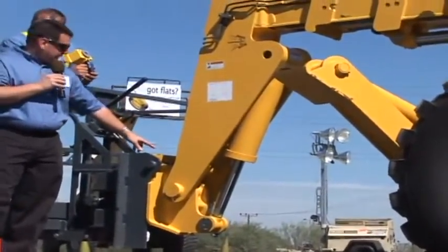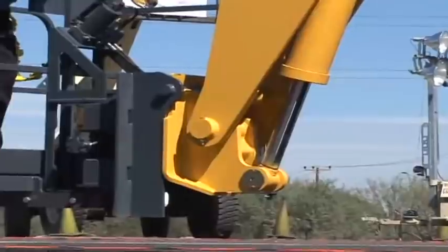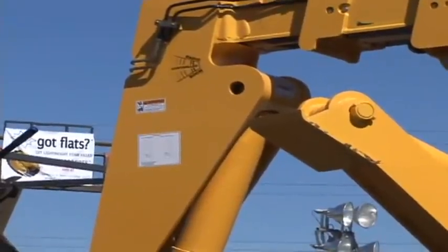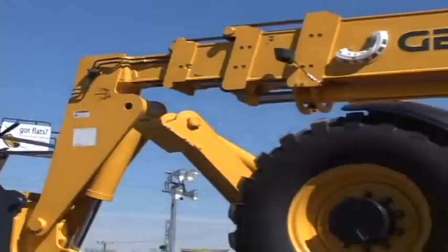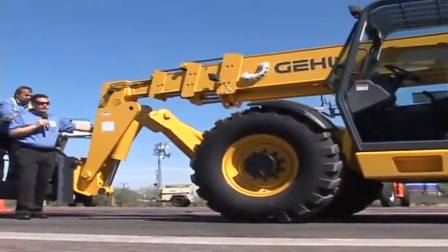This is the Dyna attach that we have. It's a narrow one, used for lift and place type applications. Then we also have what we call a Dyna carrier, which is a wide mount type attachment, which would be used for bucket or high force applications in which you want more stability at the horse head. We also have the auxiliary hydraulics that's standard on our 55 foot boom. That's on the other side, which we'll get to.